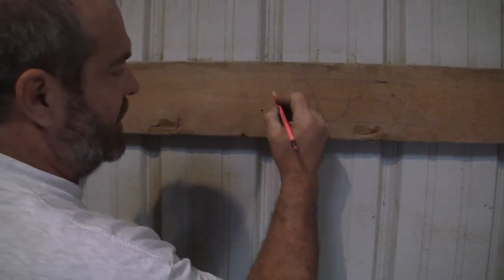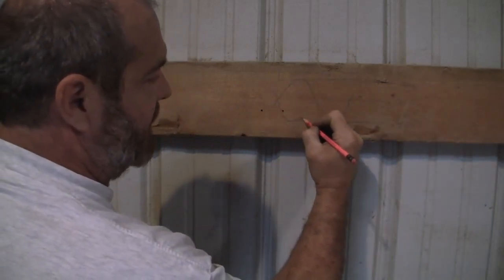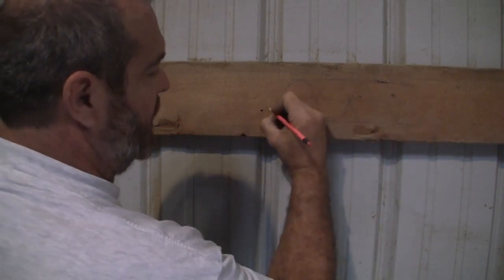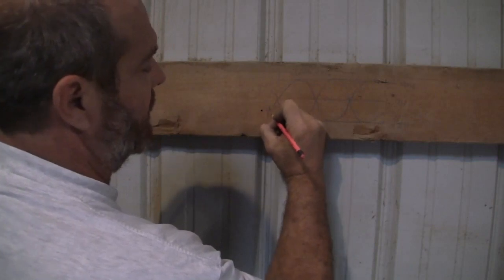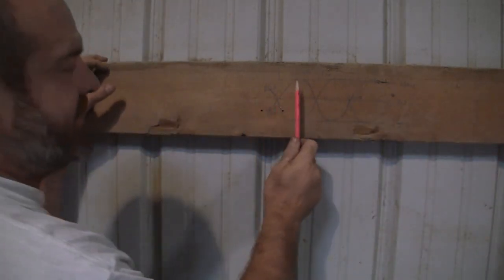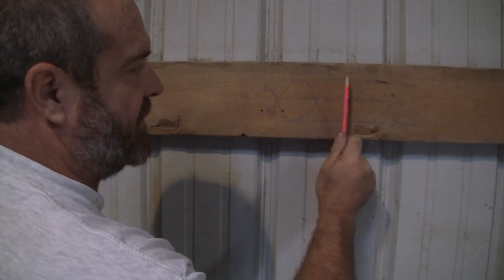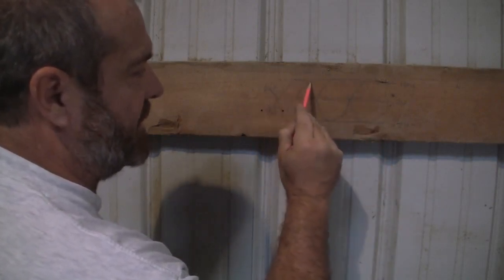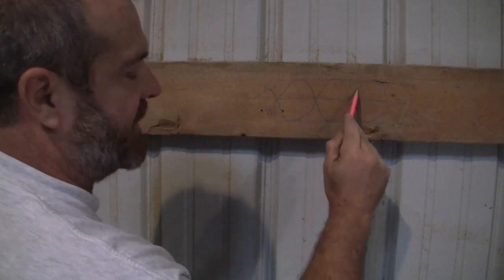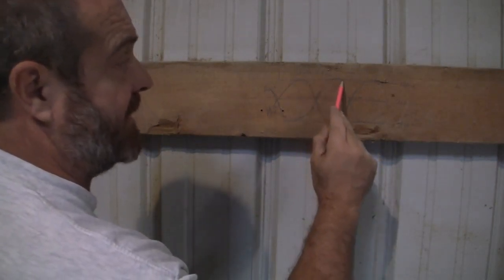When you have 240, this continues on forever, okay? It just keeps on going and going and going. When you have 240, this is coming down like that, coming back up over the top, coming back down, just like that. So this one here would be the white wire or the red wire, and this is the black wire. All right, and this is your ground running across. So what this does for a motor is there's more electricity being transmitted, and it makes them run smoother because they're only hitting these highs here, okay? So as you can see, with the 120, they have to wait for the end of the cycle, the next cycle coming in. With the 240, you get the next cycle coming in while that 120 is dying off. So the second leg comes in and takes it in.